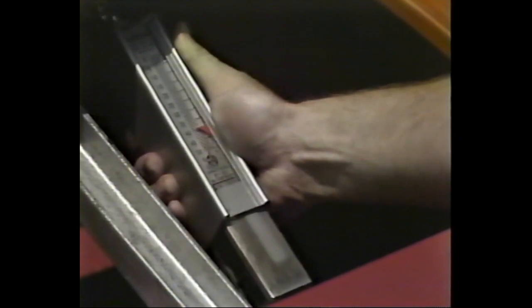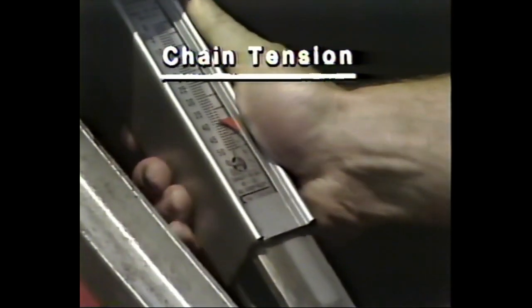Now you're ready to make a thorough inspection of the combine's various internal systems. Let's begin by discussing the chain and slat type elevator first, then cover the paddle elevator. We'll proceed step by step through the process of inspecting and adjusting both of these vital mechanisms. The first step in inspecting a chain and slat elevator is to check the tension of the chains.